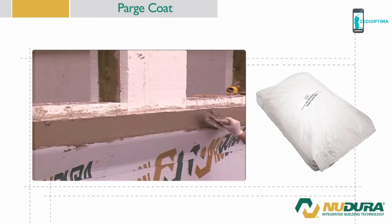Apply the finish coat of Parging 24 hours after the base coat has been applied. Architectural designs can now be created on the finish coat to suit the requirements of the structure.